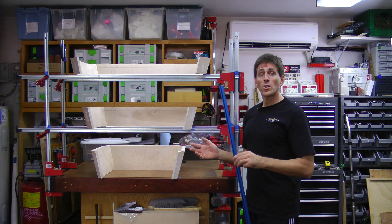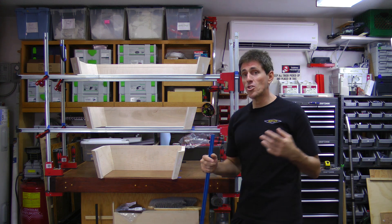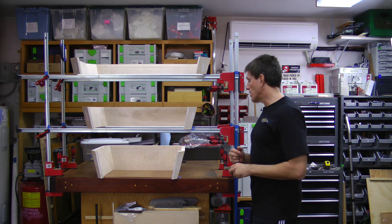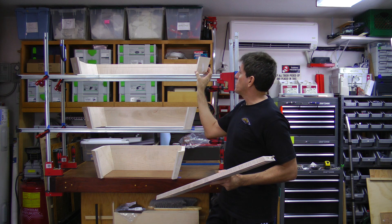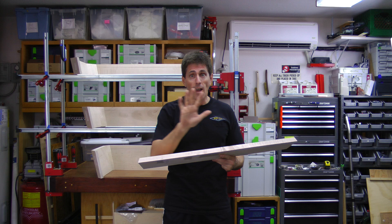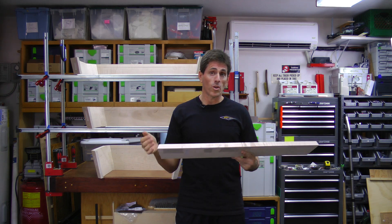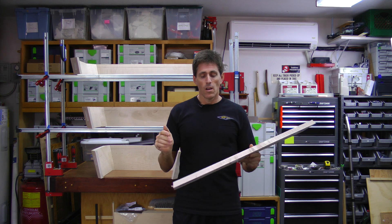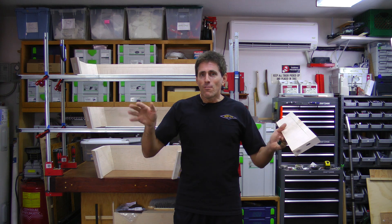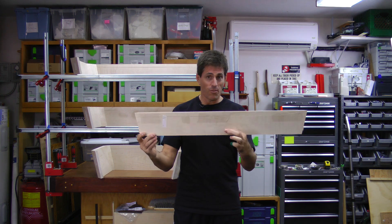I want the column to have a proportional taper to the sides of the cabinet — that'll make it look nice. We can always adjust slightly, but I do want it to at least follow the sides. This piece in the front is between the faceted sides. I want to base the proportion on the flat front as opposed to the faceted sides, because when you're looking at it from the center — which is normally where you'll see an entertainment center — those faceted sides kind of feather off. The visual part to you is going to be the flat part in the middle.